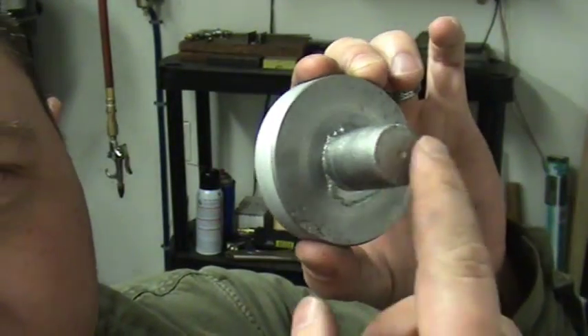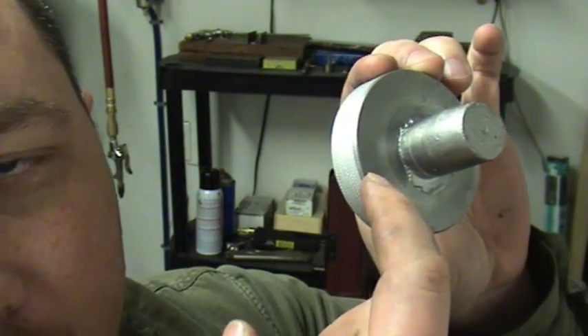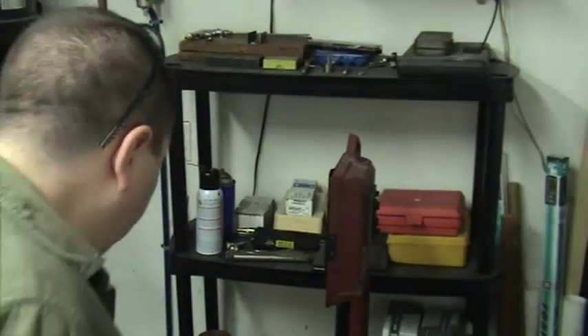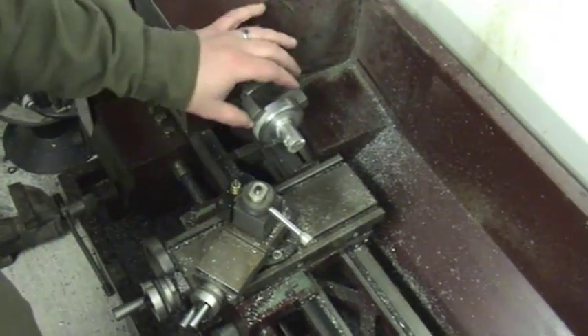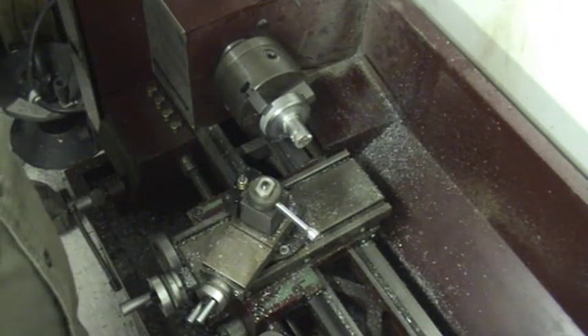Now I'm just going to work on the stem part. I'm going to face the stem, turn the outside diameter, and I might turn this face here. So I have one chucked up — I've got the outside diameter jaws on the chuck, the larger diameter — it's in there now, and when I get ready to start turning I'll turn the camera back on.